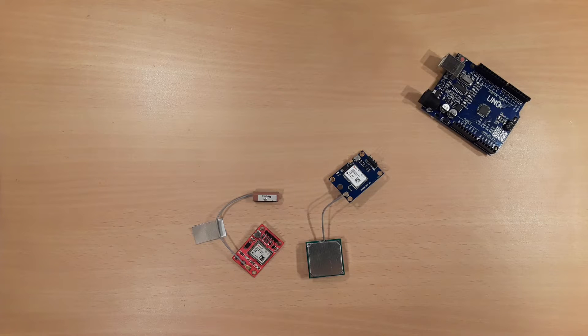Interestingly, I got a U-Blox 6Q module. According to many customer reviews, the majority gets U-Blox 6M modules. Anyways, these U-Blox modules are very comparable. The main difference is that the 6M features a crystal oscillator and the 6Q features a TCXO oscillator. Both U-Blox modules need a voltage supply at 3.3V.